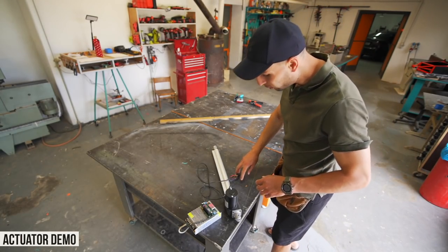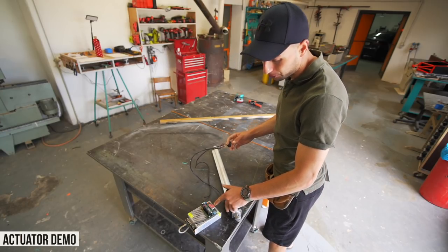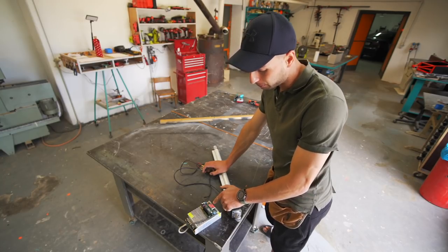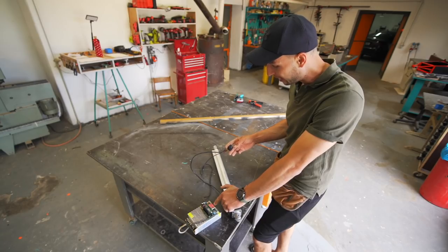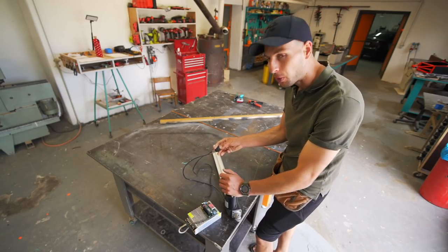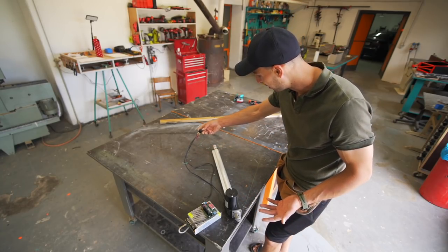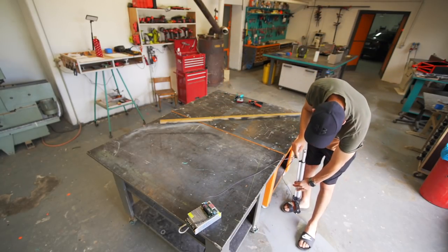Look how cool this thing is! Having an AC to DC converter with adjustable voltage. So I set it to 14.3 volts. And here this shows me current. And I also wired this polarity switching switch so I can be playing and testing this actuator and prototyping the lift. I'm absolutely stoked about how powerful this thing is.